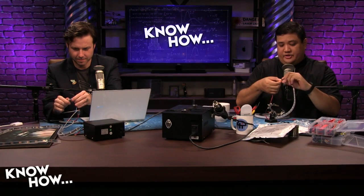So now you should be able to show them your code. Cool. Now, just carefully. One of the reasons why I put the bullets on that is we ran into this problem with the Aquavase, where if you leave it connected to the UBEC, and it's one of the cheaper Arduinos, it actually starts pushing power back into the UBEC. Is that bad? It can get really hot. Okay. So that gives you a quick way to disconnect power while you're programming. The nice thing is that, because of the bullet connectors, I was able to just disconnect it real quick and hand it over to you without having the whole LED strip and everything.